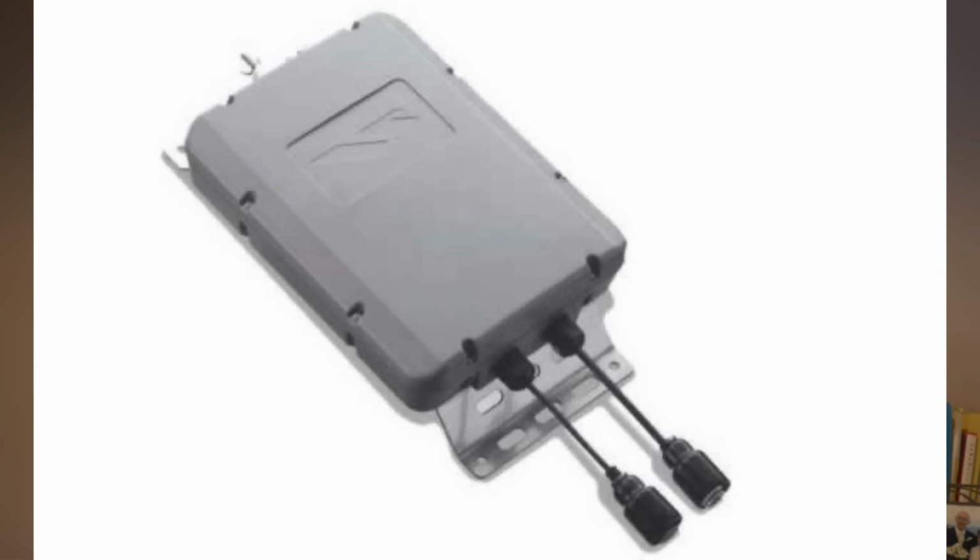Now, one thing, you must have some sort of earth system. There's an earth terminal on this ATU, and it's designed, by the way, to go outside, so it's waterproof. You can stick it outside the window on the wall, and you have your wire going to the ATU, and also a wire going down to earth, or a counterpoise, just a length of wire down the garden, lying on the ground. It needs to work against something. And that should give you 160 metres. Then it should actually give you some interesting contacts on 160 metres. And of course, it also will operate on all bands.